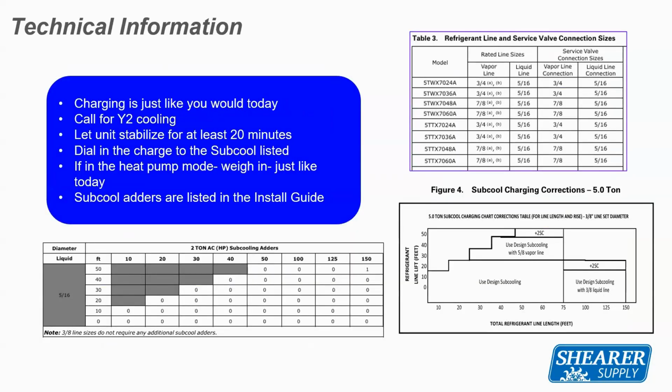Charging the unit is very similar to charging a single stage unit today. You want to make sure that you're in a Y2 call, right? You can actually look at the control board on that condenser, see the 30 on the board. That's going to tell you that I've got a Y2 call, and then I'm setting it to my subcooling, just like we've always done in the past, okay? Now, if you've got a super long line set, there are adders that you're going to need to add for that longer line set, and that's no different than any of our other product. If you're doing link systems or even a single stage 14 SEER, if you look in the installation guide and you've got a long line set, there may be cases that you're going to have to add to that subcooling number, and that's what it's displaying to you here.